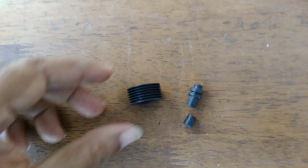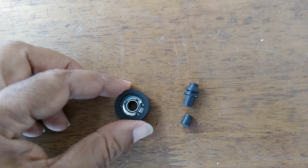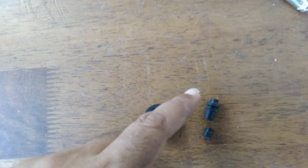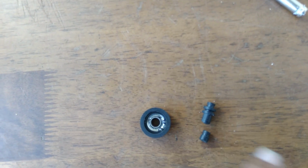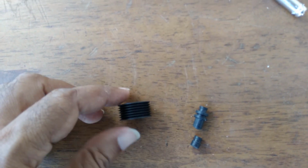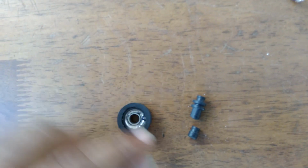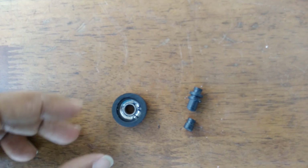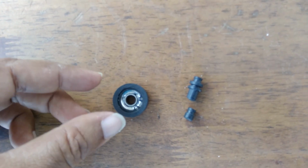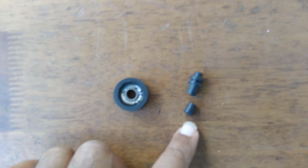This is the pulley in a plotter. The motor is on the side, the belt runs around and runs to the head, and that slides on a bar. This I call the idle pulley. It has a pin and it goes into a metal framework. That allows it to turn sideways a little bit. Obviously the pin has broken.